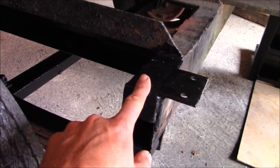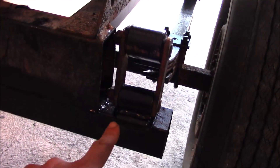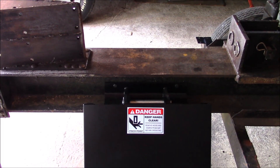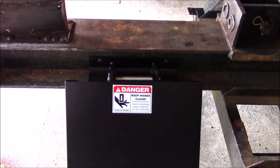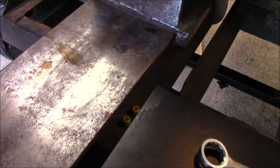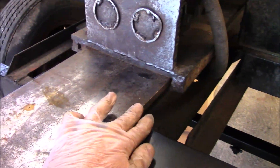Our suspension lift consisted of moving the spring eye from the top to the bottom — that was about 7 inches — and back here, moving the shackle attachment point from the top plane down 4 inches to the bottom plane. Make sure your lift table attaching hardware is mounted in the correct spot so your table lines up wherever you want in relation to your wedge. The mounting hardware is narrower than the table top — be aware. One other clearance point to check: with the table all the way up, the gap between the I-beam and the table, and the carriage — this distance needs to fit through that gap.